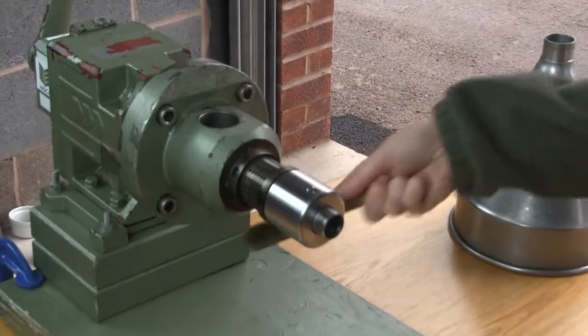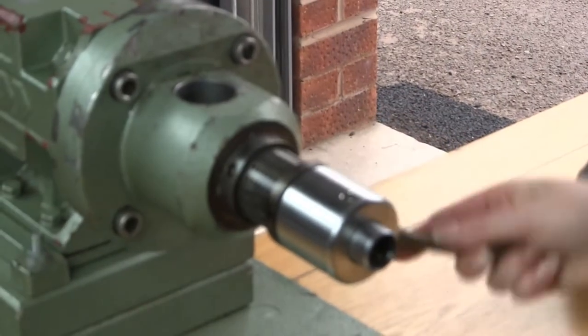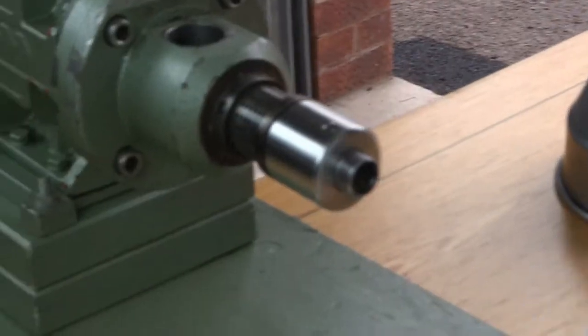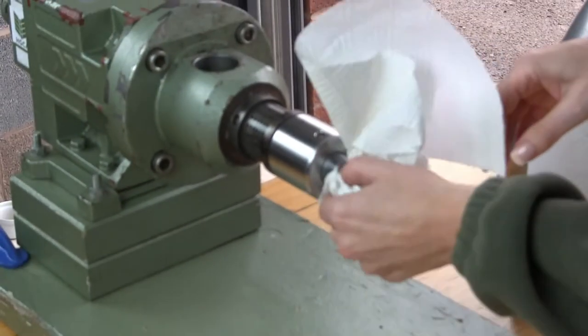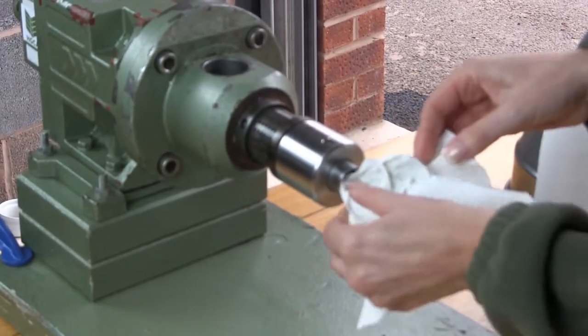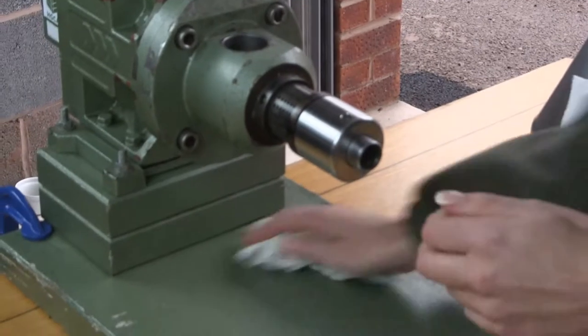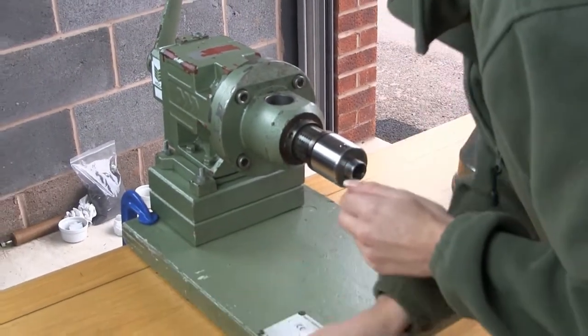At the end of your event, please use the wire brush provided to clean the press. Clean around the connection nuts, the press head, and the nozzle. Taking some kitchen roll or a cloth, clean right inside the nozzle. Before packaging the rapeseed press back in its crate, please wipe it over thoroughly.